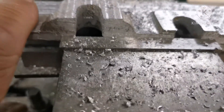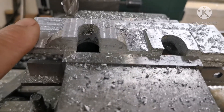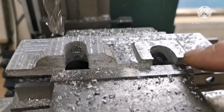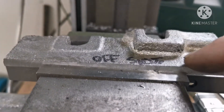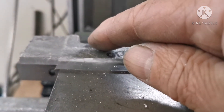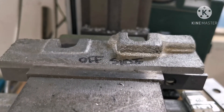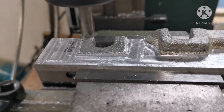This face bolts on the outside of the horn plate. These two are now machined to the right height from that face. I'll turn it over and make sure the parts are the right thickness in the areas that matter. I'm going to machine this face up to clean it up, then take 1/32 off there and another 2/32 off there — that will make that the right thickness. I'm just taking a sixteenth of an inch off there.